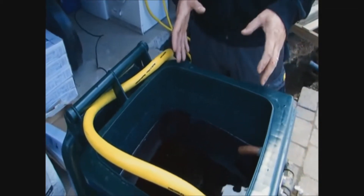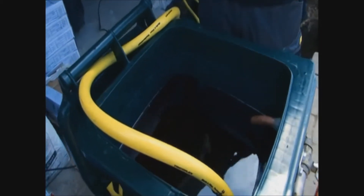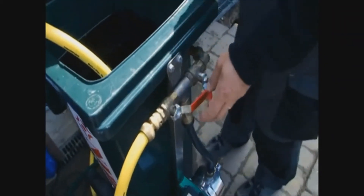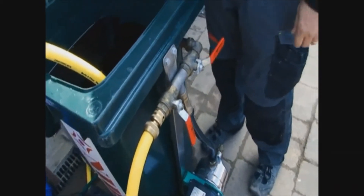So now we've got the collection bin full of brine and water. It's mixed to approximately minus 17, but even though it's in here and it's ready to go into the system, we've now got to mix it in the collection bin. If we did pump it straight into the system as it was, the system would pump round as brine and water and it wouldn't be in a mixed form. So all we need to do is on the front of the collection bucket we have two valves — we have to shut that one, open that one, and all we're going to do now is circulate the brine round the actual collection bin.